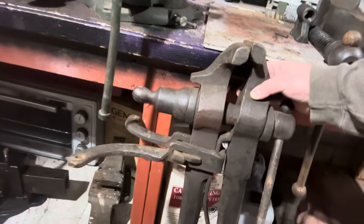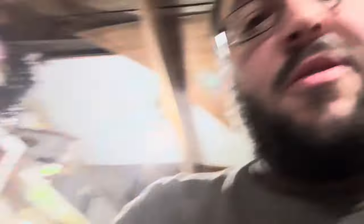Thank you for joining me — I am Daniel. Before I go, I want to show you my little tool haul from yesterday. I went on Craigslist and picked up this four-inch blacksmith post vise. You'll notice the jaws aren't aligned — it's actually bent a little here, but I can get that in the forge, get it hot, and bend it back over. This is wrought iron, and it does take to forging fairly well. I can actually straighten that out and get it aligned much better. The threads on the screw box and everything in here is in great shape. The tenon is in great shape.